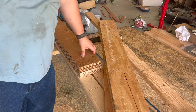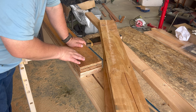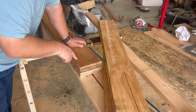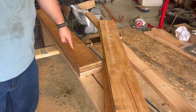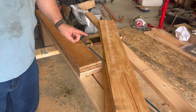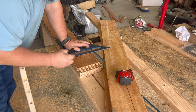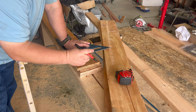I've taken four of those strips and cut them in half, so we've now got eight pieces. The next step is to draw out and cut a receiver hole where these pieces can interlock together. It just needs to be the thickness of the plywood, maybe a hair over to make it easier to put together and take apart, and it needs to be half the width of each of these strips. We need four cuts into each of the eight short pieces, and then the four pieces that go lengthwise are going to need eight cuts each. I'm going to use the jigsaw. I'm going to go four inches in and three inches deep.